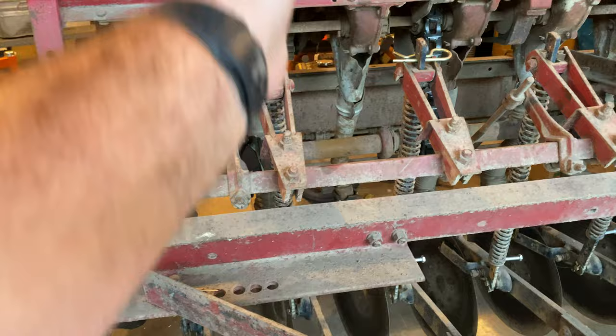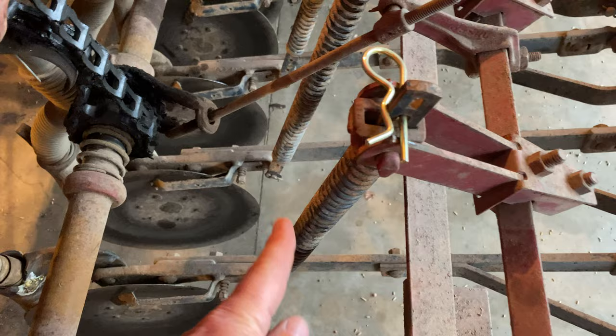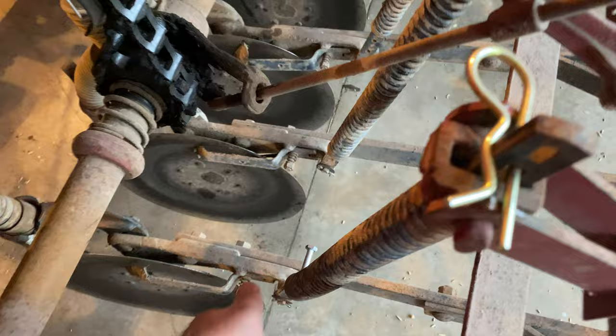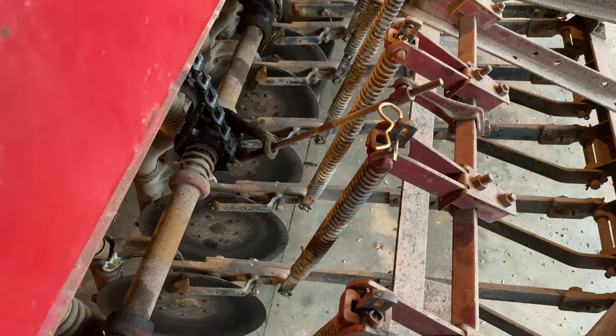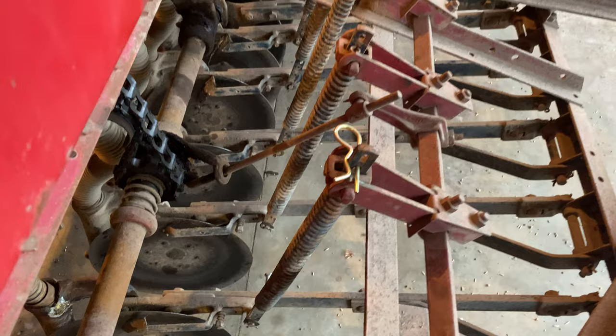Each vertical position: look at the cup, the tube, and the disc. And then there are springs — there's a spring putting tension down on each individual disc. Make sure there is a spring there, make sure it's not frozen. I can grab this and pull it up or push it down to put different amounts of tension — different amounts of pressure down into the dirt. Make sure the springs are in decent condition and that you can move and adjust them. If they're frozen, it's up to you whether it's worth fixing. Look over all the mechanisms and make sure nothing's missing.